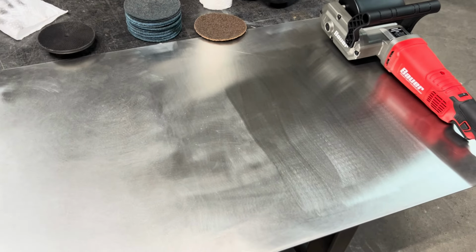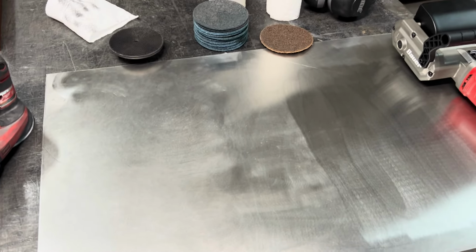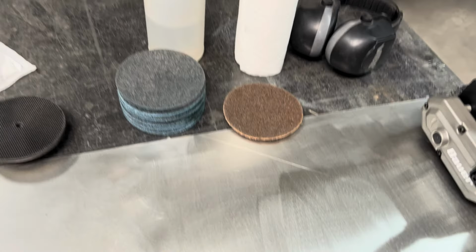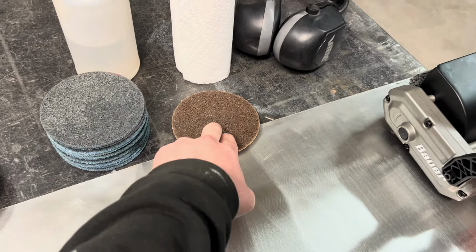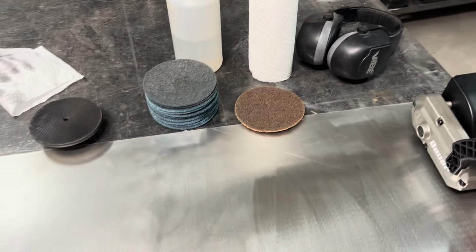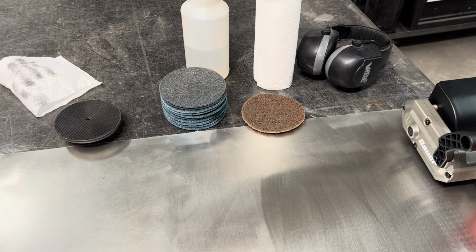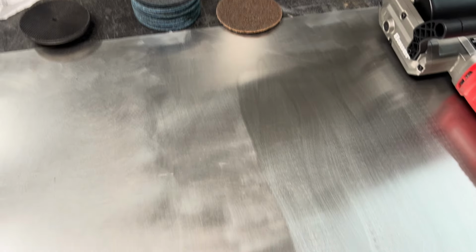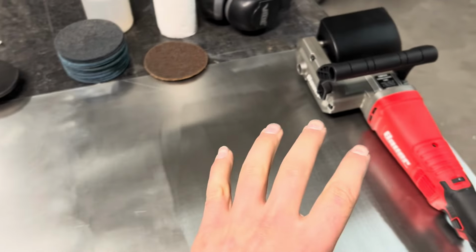So I had to figure out, okay, what does a good stainless steel finish look like? So what I traditionally do, if I'm gonna finish my fabrication stuff, I just take the brown Scotch-Brites and go over all the corners, and that does wonders. Powder coat going over it looks beautiful, paint going over it looks beautiful, but it's not a raw finish if we're putting paints over it. So we're trying to figure out how to put an even finish along this whole thing.